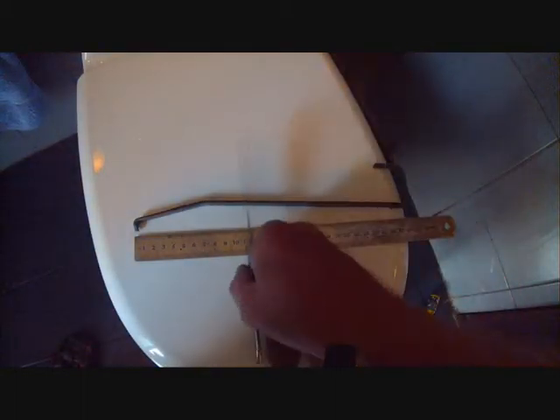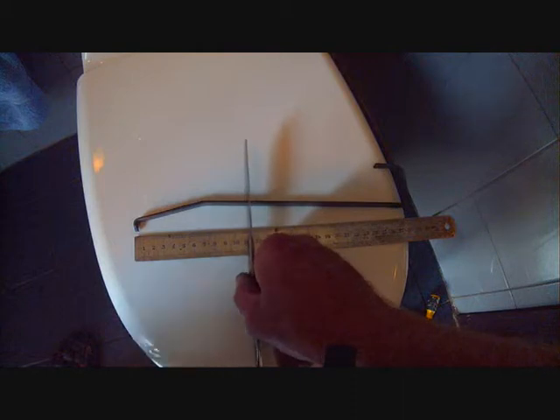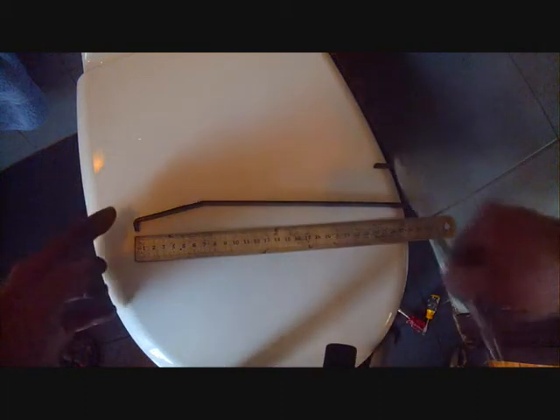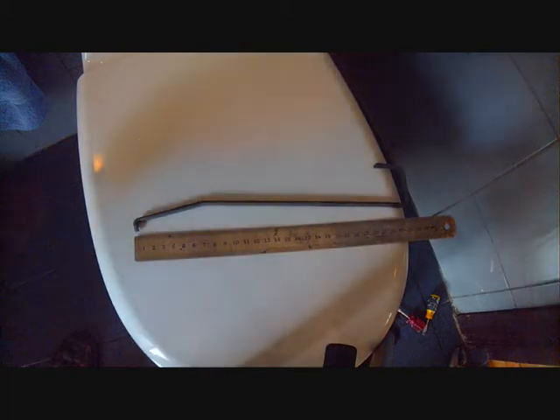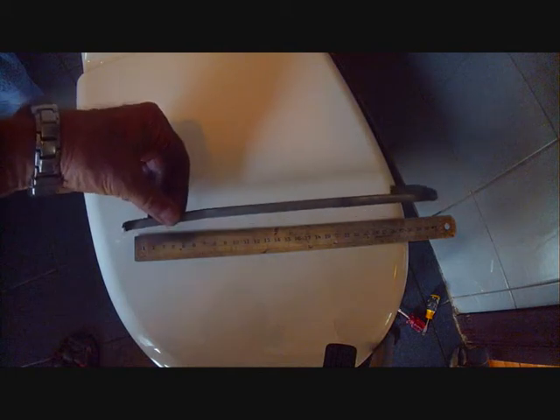Hopefully that's okay. Here's the little tool I've made. It's got a lip here of about 10mm, and it's about 5mm thick on this end — about 5mm across there to fit the gap. It needs to be at least 110mm long, 11cm, because that will be the top of the system and it has to reach down 110mm to click the little plastic tag. This length doesn't matter, but it's handy to have a little handle on top. It's made out of 8mm thick flat mild steel, but you could probably use a little bit of fairly strong wire to do the same job.